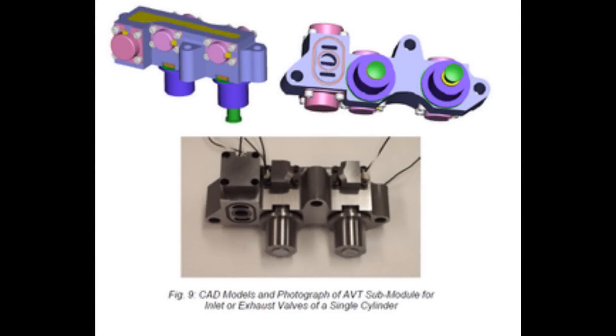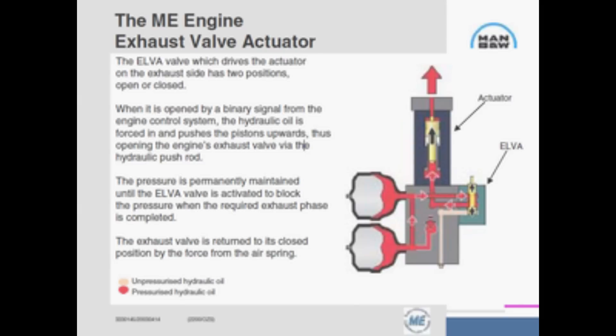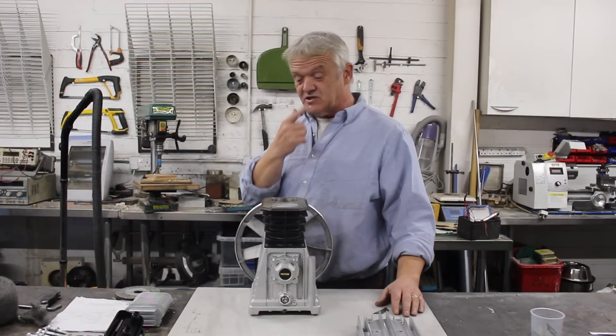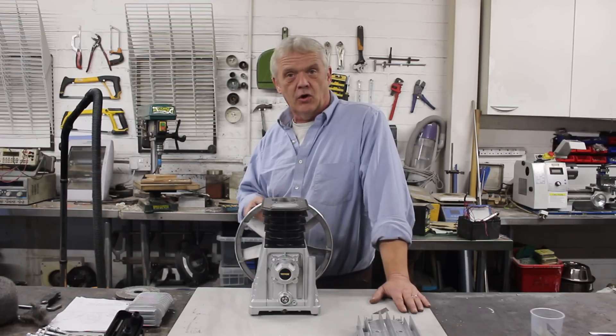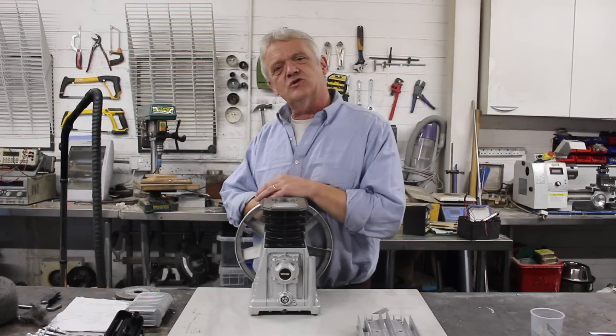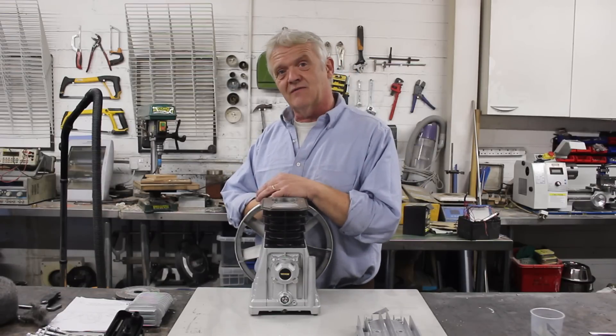The final type is the solenoid type, and they're already available for internal combustion engines — they've been used in marine diesel engines since about 2003. The advantages are obviously the control: you can control the timing and change it through the engine control unit without all that tedious mucking around with chains and timing belts. My own favourites are the rotary valve controlled by a stepper motor or the solenoid valve, because you don't have to create all of those linkages — the engineering is very much simplified — and an Arduino will cope with something like that relatively easily.